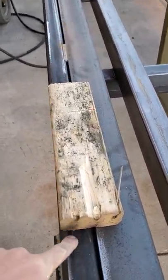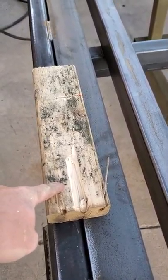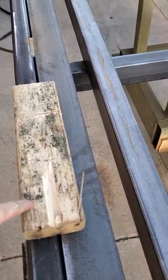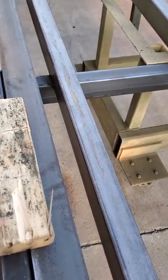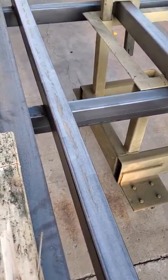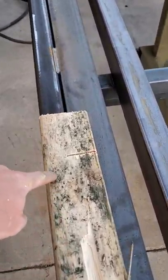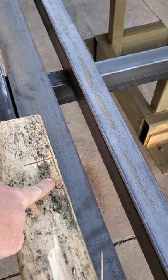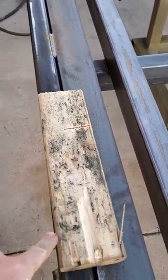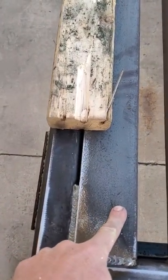Right here is a two-inch tube. You want to hit your bottom plate with a seven thirty-second drill bit and then a quarter-by-twenty deck screw — same that you used for your subfloor, just longer. I like the two and a half inch or three inch, and then you're gonna move eight inches over to the other side of the bottom plate, so it's a zigzag back and forth between this tube and this flange.